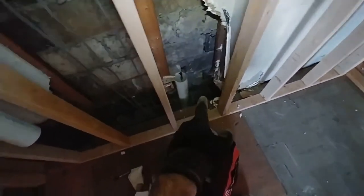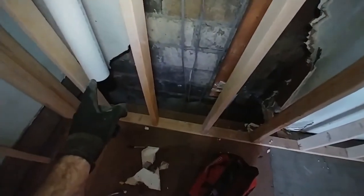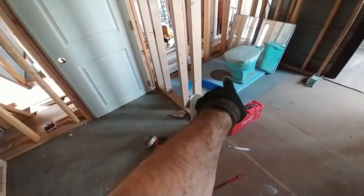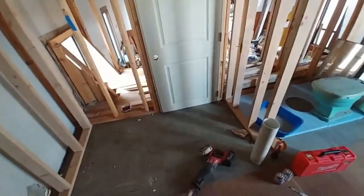I just threw this one piece on since I've been here. That's all the further I've gotten, but I've got to jog over and get to there. And then we've got to roll through two sinks and come in, and we've got to be under the floor. We've got to come over, turn, and tie into it from the toilet. And then at the side of the toilet run, we've got to catch the shower over to there as well. Those couple things will be downstairs.